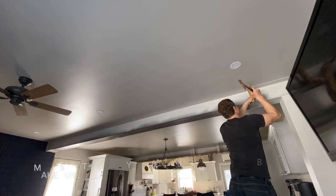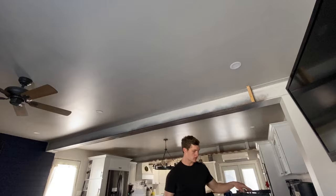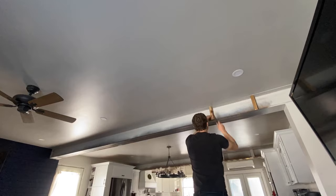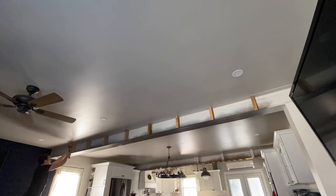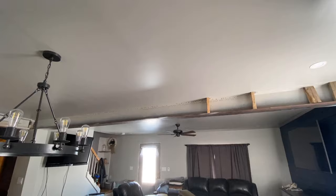This was a bit of a learning curve for me too, because I had never done it before. You really want to make sure that these 2x4s are nice and tight. Take your measurements to make sure everything is set, then begin putting them all in — make sure they're all 2 feet on center. You can even go back and mark your ceiling with little faint marks so you know exactly where those 2x4s are, because once you put the beams up, you're not going to be able to tell where they are.